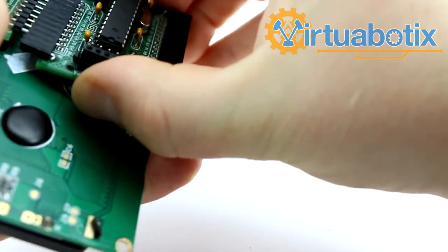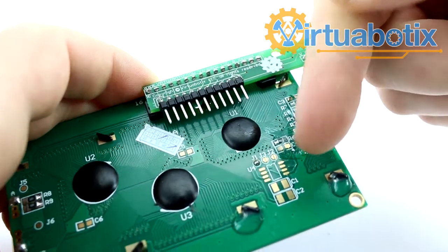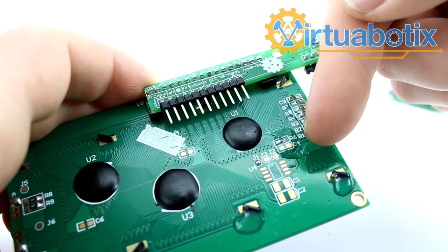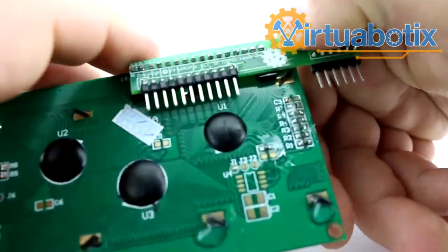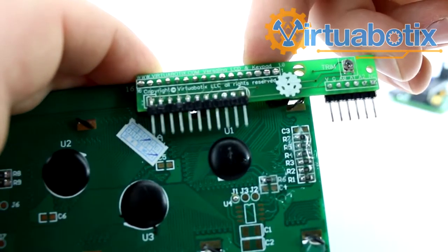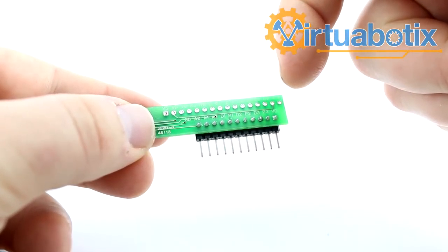Let's go ahead and look at the way this plugs in. Over here I have a fully assembled one. The first thing we did was put some hot glue over these electronics here to make sure they would not end up causing a short between power and ground. Then we soldered on matching up pins 1 and 16. There are also pin names here, and on the other side of the actual board it will tell you what each pin is, so you can line it up with just about any LCD.